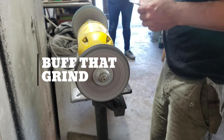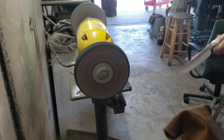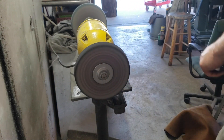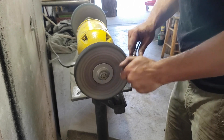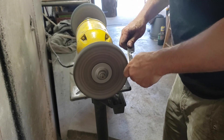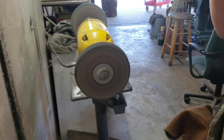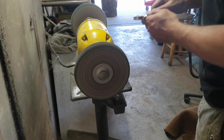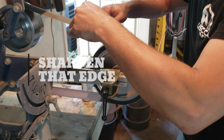Now I'm moving over to the buffing wheel — the most dangerous tool in the shop because it can grab stuff and fling it. You'll notice there are some holes behind there; those are from pieces that got ripped out of my hand and went into the wall. This is a 400 grit wheel. I get the 400 grit abrasive compound from JantzKnifeMaking.com. I have a green compound and a pink compound — green is for metal cleanup, pink is for handles. Keep your pieces angled down and keep your head and body as much to the side as possible to reduce that tip coming back and getting stuck in your stomach.